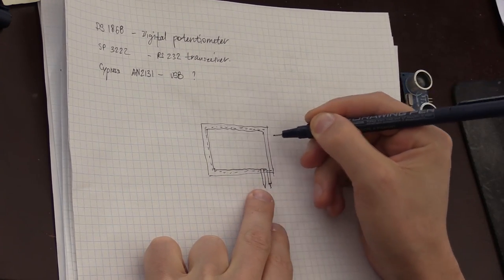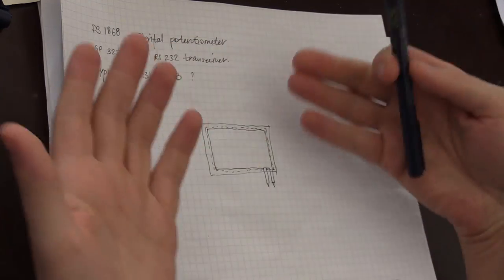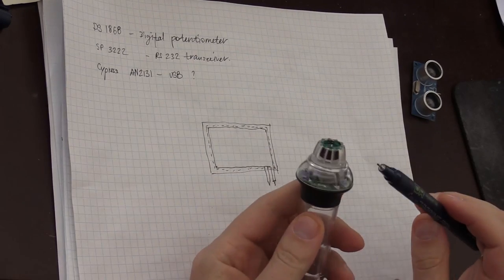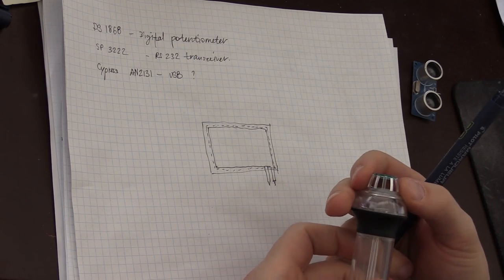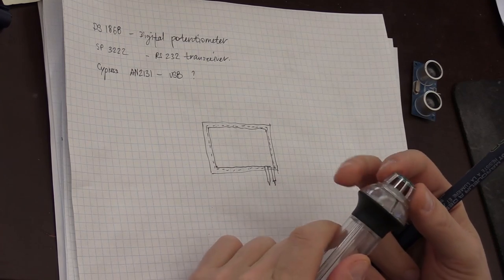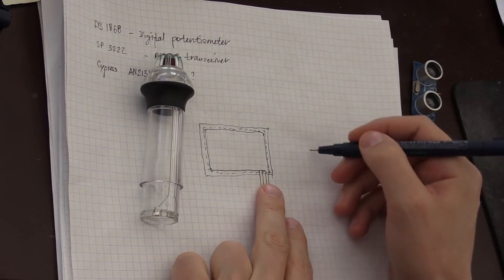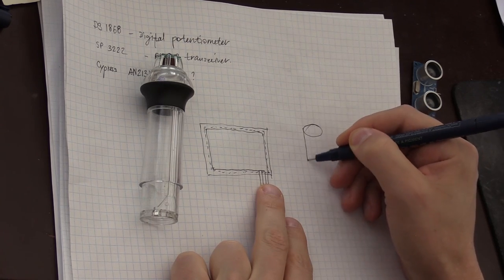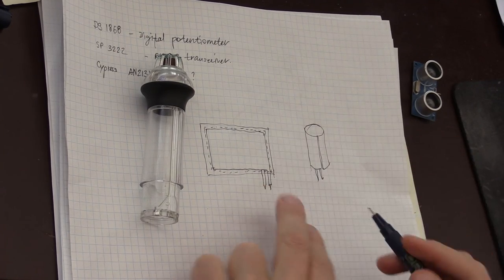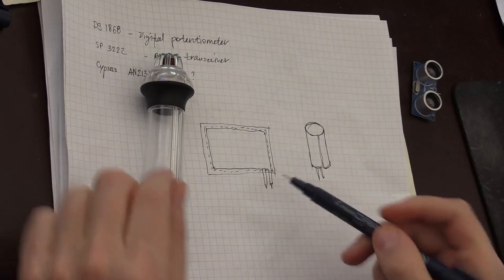conductive layer, sort of like the same thing that you see on double-layer PCB boards. One layer is copper on the top and another one on the bottom. I believe this one is going to be a thin layer of silver or another conductive material, applied by using some technique such as sputtering. What you can do next is wrap this film into a cylinder. So you will have a cylinder like this, with some gap, I have to say, and then there are contacts. So this is how they built this ultrasound transmitter in this case.